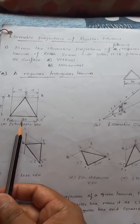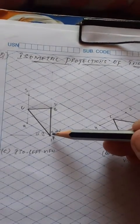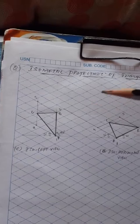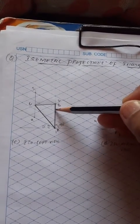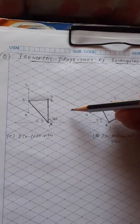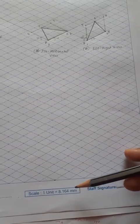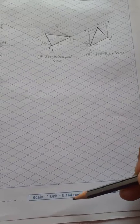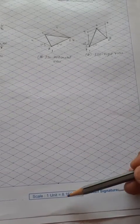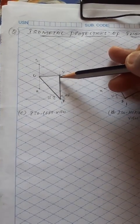From point 1 to point 2, the distance is 30 mm. You can measure directly on the isometric sheet using the blocks — 30 mm means three centimeters means three blocks: one, two, three. One box is one centimeter on the actual scale, but on the isometric scale it is 8.164 mm. So 10 mm actual equals 8.164 mm isometric, or one centimeter equals 0.816 centimeter. To measure 30 mm, count three blocks and name that point as 2.